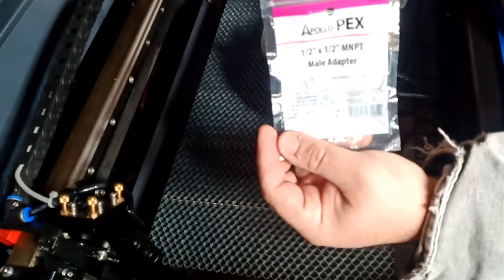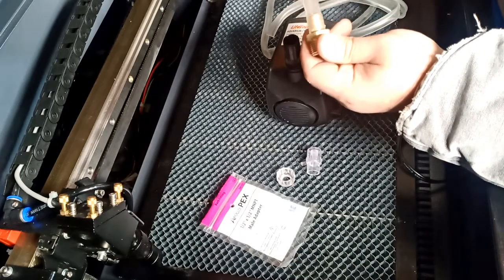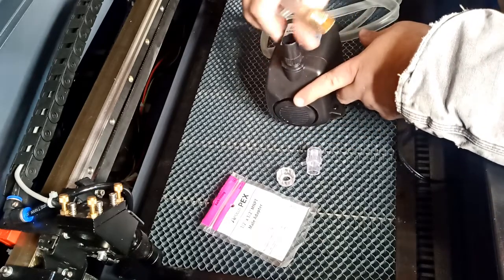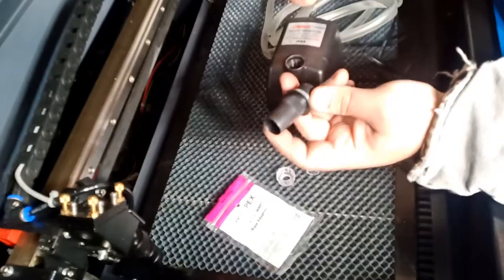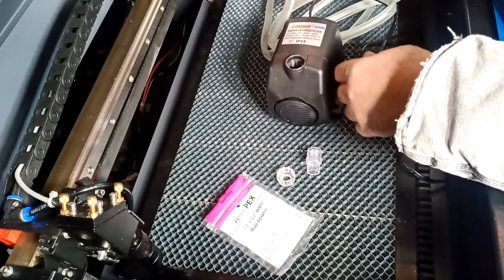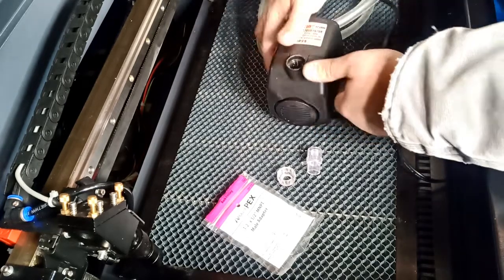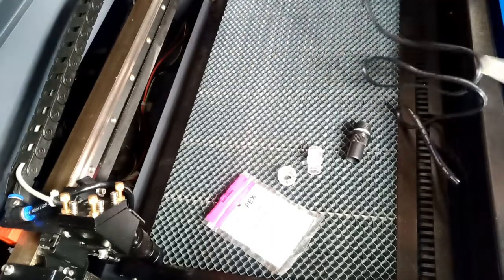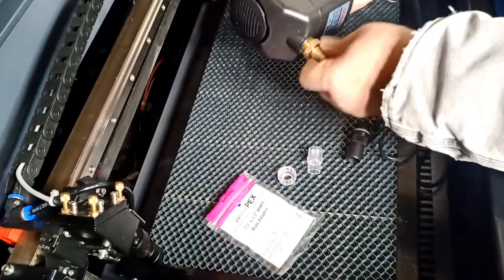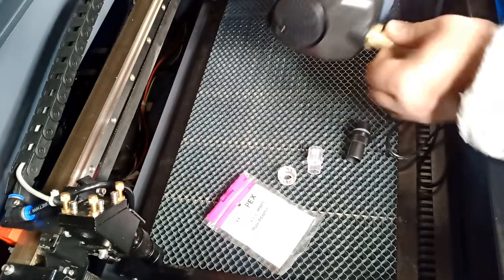You can find this brand online — let me see if you can see it better. You can also scan the barcode if you want. What I did was heat this tube up and force it in — it's not coming out. This adapter opens up with a screw and it's a half-inch diameter. If you don't know the sizes, just take the fitting with you to Home Depot to match it and make sure you get the right stuff. I'll attach this to the hose. The hose is long enough for my application. You can use Teflon tape but I don't think it's necessary — it's tight enough.